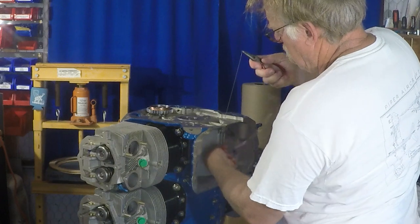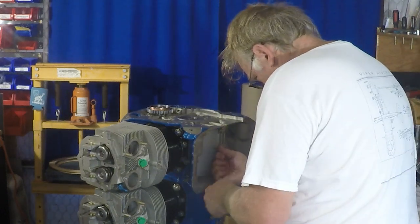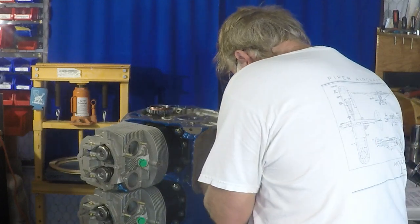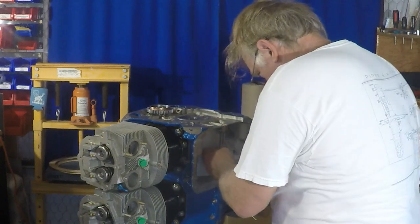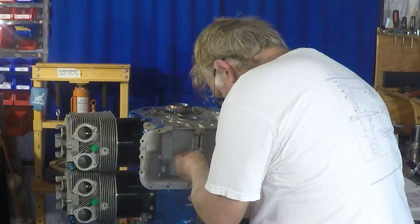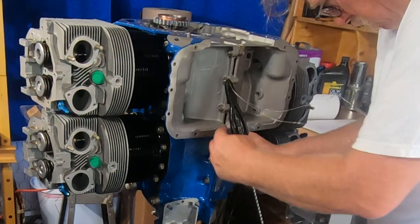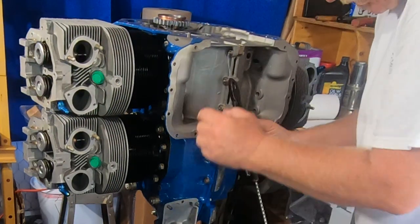Now this is kind of a unique safety wire in our biz, in that there's no real rocket science to it, but it's a neutral safety. So all of the cotter key or the safety wire holes are all lined up in a straight line. It's basically a neutral safety. Because there's bolts and not studs, you just give it a neutral safety.